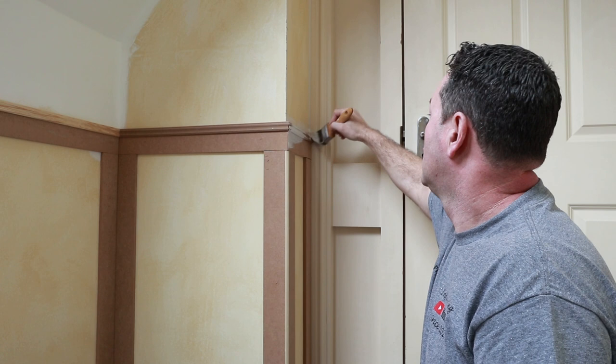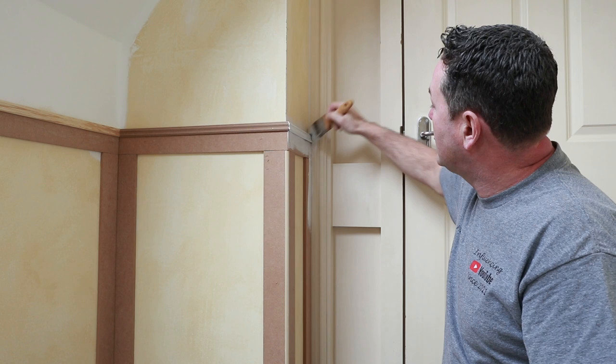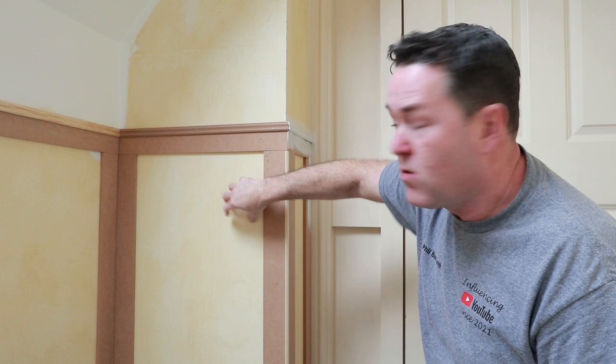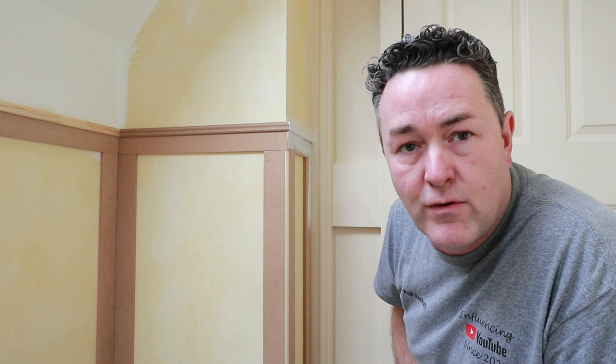Load your brush up — this is done in no particular order, just so you can see it. I've been talking too long and I've got to bed it back in. Don't worry about going onto the woodwork around it — I'm going to be doing that anyway. I am going onto the wall and I'll scrub it out so it's not a fat edge. The top edge will need caulking, and these edges around there will all need caulking, to give the base grip.